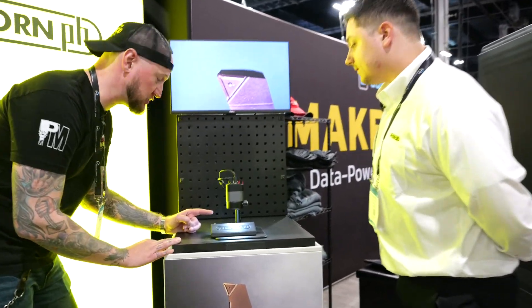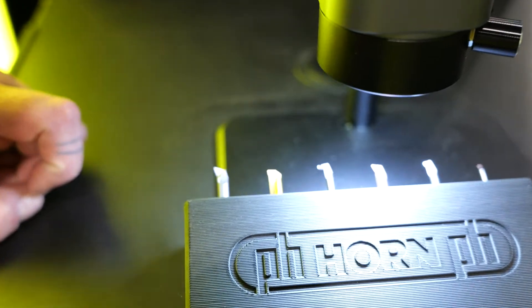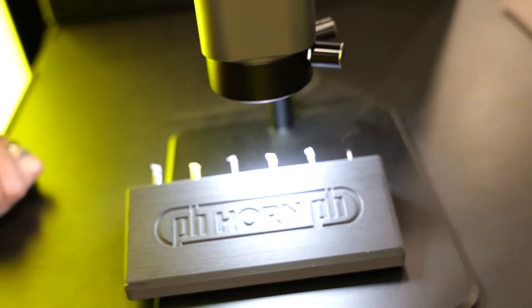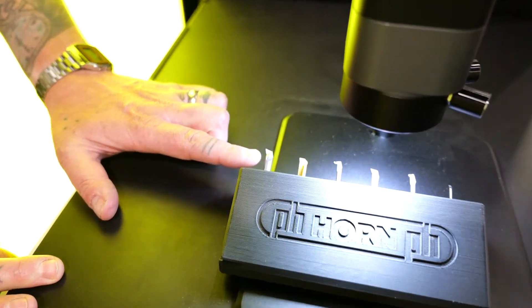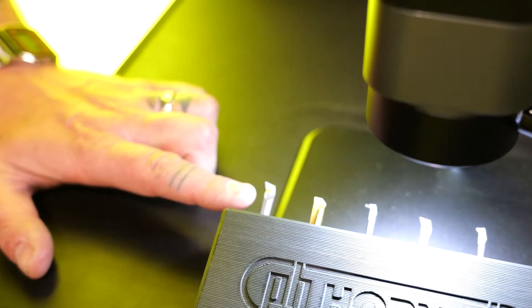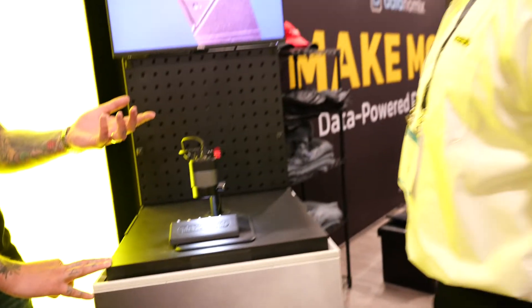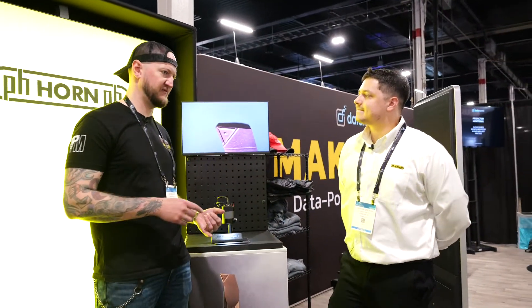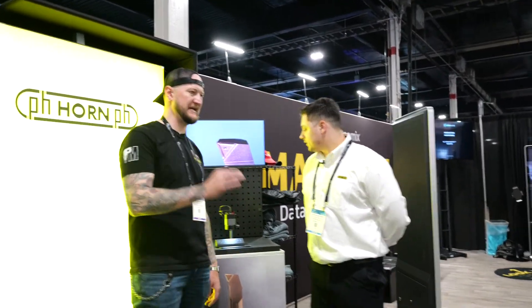These things are tiny — I wouldn't want to try to grind those even if I could. It looks like you almost have an internal grooving tool there. Yes, that one's probably about a millimeter wide. The 105 series has grooving inserts, face grooving inserts, profiling inserts, and threading inserts. And that small diameter actually has through cooling — yes, they all do. Every single one in the super mini series has through coolant. It's super important when doing tough stainless grades because if it starts getting hot, you're going to work-harden it and snap it. We've run those in 316 and 304 for really tiny bore diameters and counter bores — they have been very, very good.